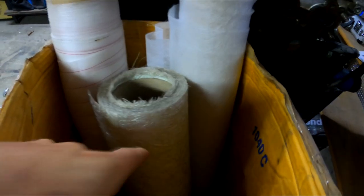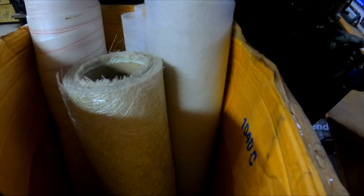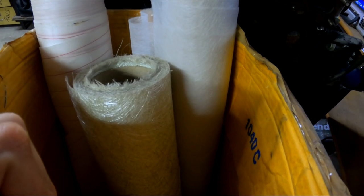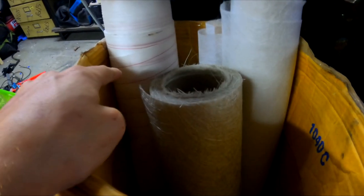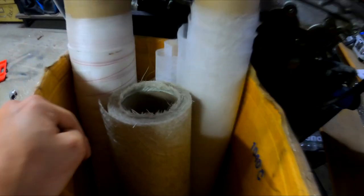We've attached a piece of wood, faired it in and filled all the voids so we can start laying up glass over the entire thing. With the chop strand we're going to lay up on each side, wrapping around and overlapping on the edges so the leading edge and trailing edge has a double layup. I'll probably do three or four layers on each side, maybe even five, then tissue, then peel ply to avoid voids, and then sand and fair so it's nice and smooth and ready for paint.